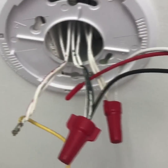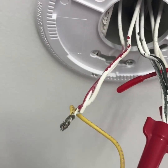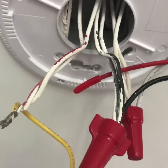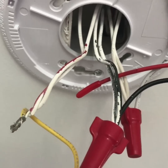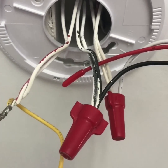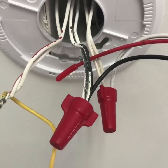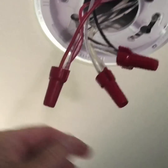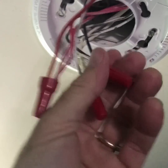The new unit has a red wire where the old one had yellow. The old yellow wire connects to a white wire, but the electrician was smart enough to paint some red on it. Connect red to where yellow used to be. You'll notice the red wire has a cap on it — that's because it's not essential to connect it. You only connect the red if you want all smoke detectors to alarm when one detects smoke, which is a safety feature that's highly recommended. After connecting each wire, pull on it to make sure it's well secured by the cap.